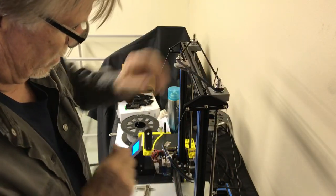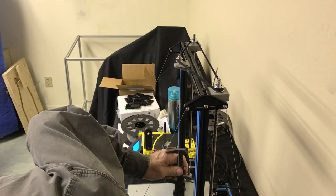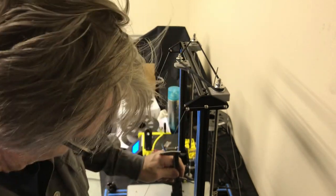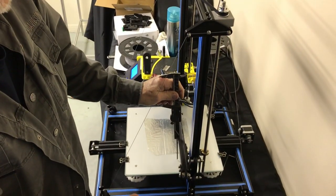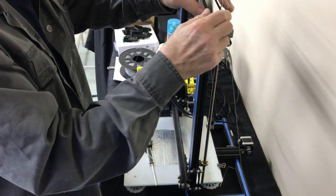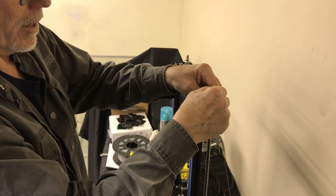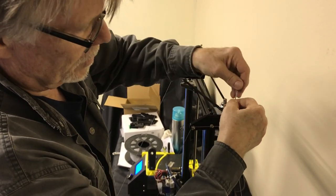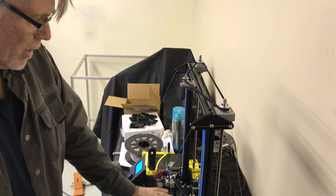Okay. We're scratching the surface right now. I don't know if you can hear that. We're just scratching the surface of the table with that. So we're level. We are perfectly level on this. So go ahead and tighten these up. Push down on these. Make sure they're down all the way when you do that. This one already has a little tension on it, so we know we're there. I'm going to go ahead and just give this a little pop there. Belt's tight. Bar's perfectly level.